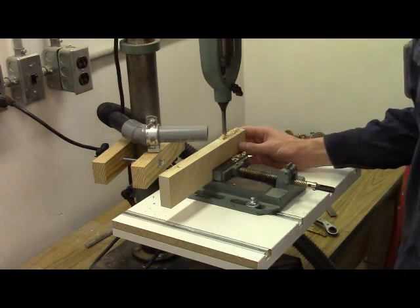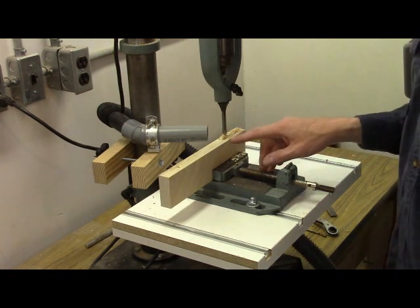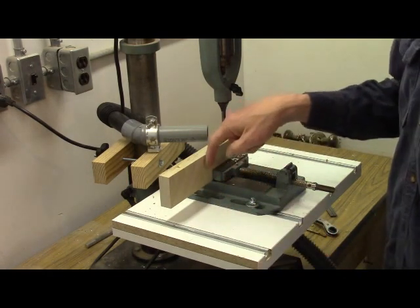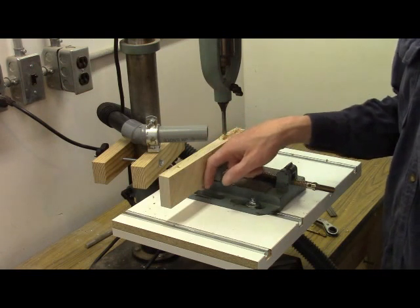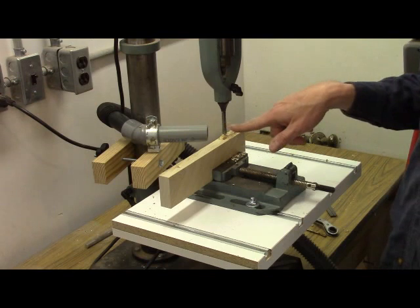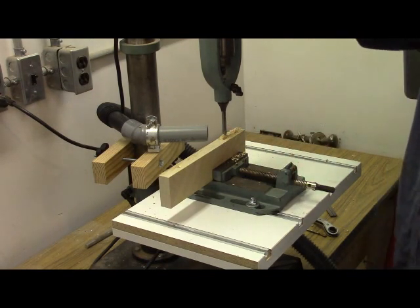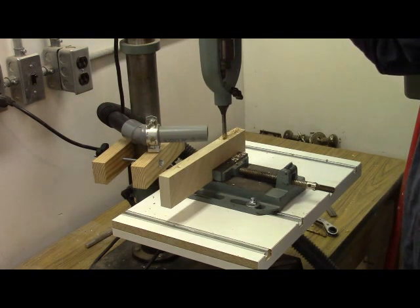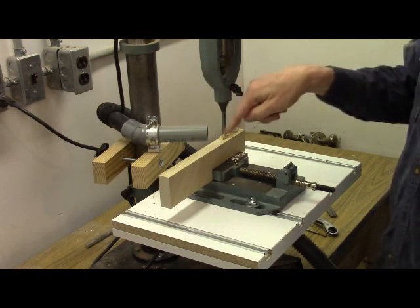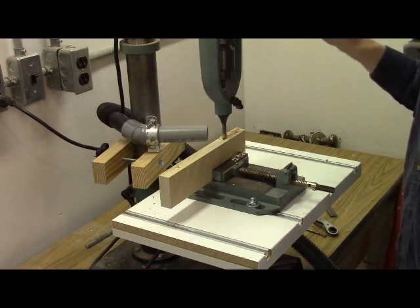You might notice one thing, and one thing I neglected to say. Unless the depth is absolutely critical, I don't bother with a positive stop — I just use a magic marker line on the chisel. When going in, I let it kind of find its center, because there is a little bit of play in the attachment — you can see it move back and forth with a little wobble. You want that wobble to disappear, and then plunge in.